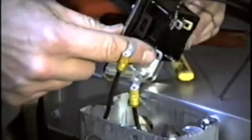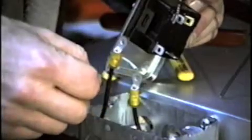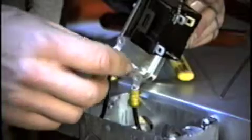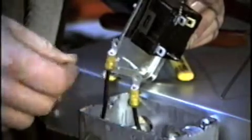I'm going to put this wire onto this crimp lug now. It's actually a little bit heavier duty than the regular ones and they don't cost any more. One advantage is they've got much stronger terminals that have a hole in them if you want the option of using a screw terminal. The screw terminals are a much more positive contact, and for a load like this where these connections might actually get warm, it's a good idea to have a much stronger contact.